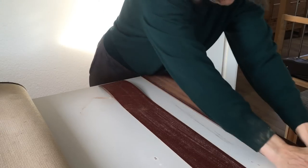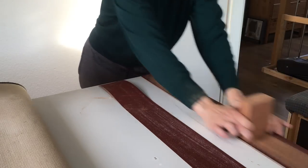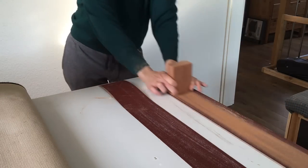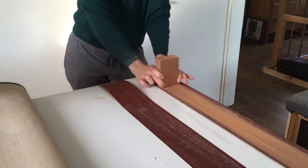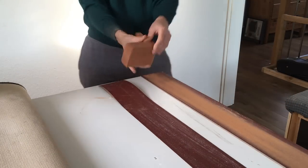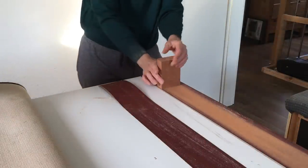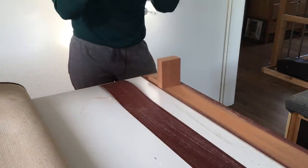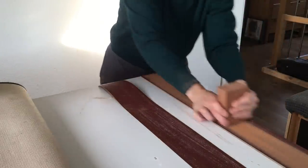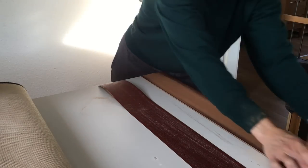All the different guitar shapes that I built have a flat neck block, meaning that my jigs are designed in a way that when I put in the neck block and glue it to the sides, I end up with a relatively flat surface already, which makes fitting the neck later a lot easier. I know that some people have rounded neck blocks, but that makes fitting the neck a bit more difficult because you would have to adjust for the rounded surface.